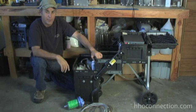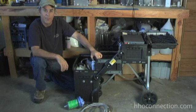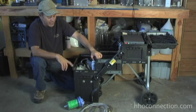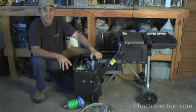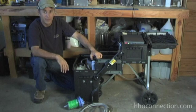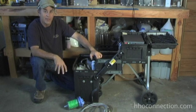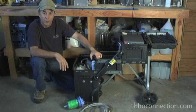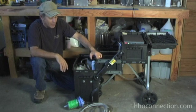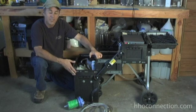Regardless, I am going to fire it up and show you what it can do — how big a flame I can get out of it depending on how much power I send it from my 40-amp power supply. But before I do, I want to take a quick minute to tell anybody getting into this: if you want to build yourself an HHO torch, don't even think about it unless you've got some good flashback protection. It's something you absolutely have to have, because every single time you turn off that torch you're going to get a flashback. You've got to keep that from going down the line and blowing up your bubblers and possibly your whole HHO system. I've got three lines of flashback protection before it even gets into my box — probably overkill, but that's what I run.